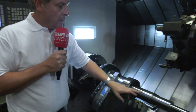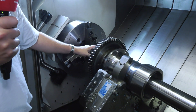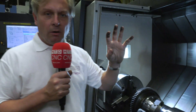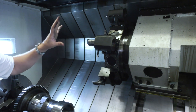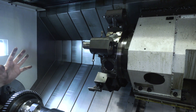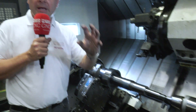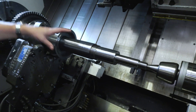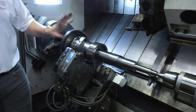Now on this part here, this is steel, then the other end — engineer's sort of kryptonite, Inconel here — so extremely difficult material. On this machine, you've got a full C axis, so you can do your turning and your milling. And here you've got 12 driven tools, so you can do that turning and milling function. As you can see just from the machine itself, huge casting there, so exceptionally rigid. It will take some big cuts and some accurate parts.